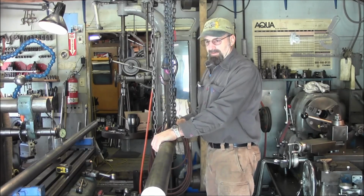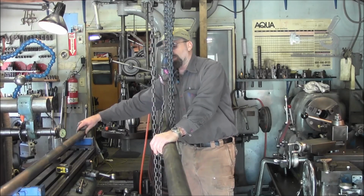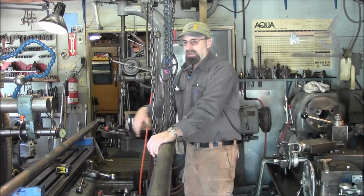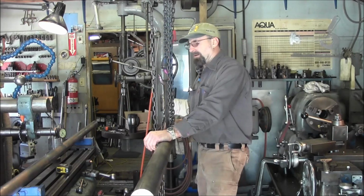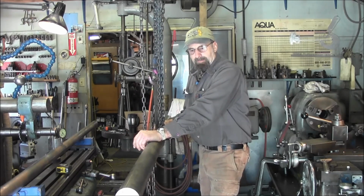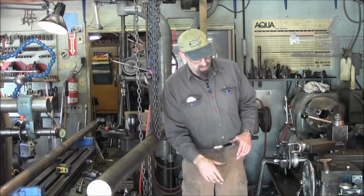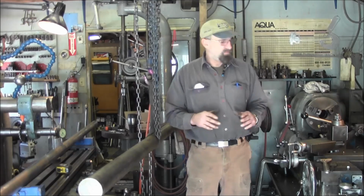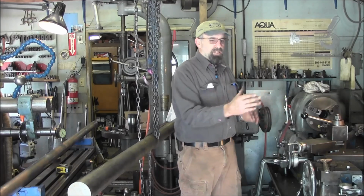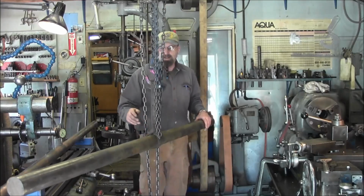This shaft we have over here in the K&T on the rollers is a piece of 2-inch cold roll that we ordered, and we're surprised the thing actually turns within a couple thousandths right where we have the indicator, and looks pretty good overall. We're going to be making a boring bar out of that, and then we're going to set the sleeves up in the lathe in our 3-point cradles that we've adapted to our carriage here, and we're going to use the lathe to do the line boring. Alright, so I'm going to start getting this into the lathe now.